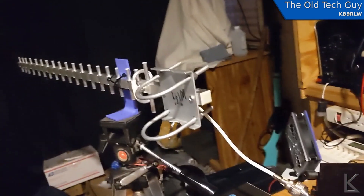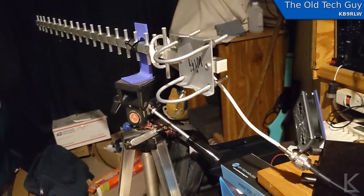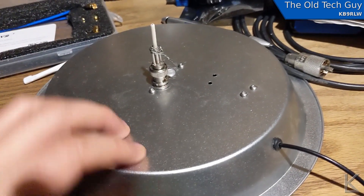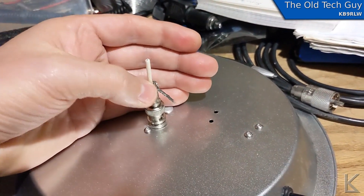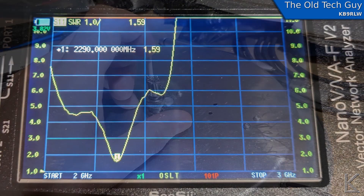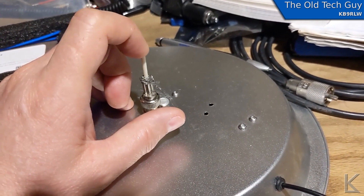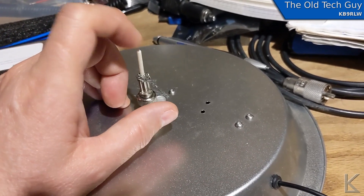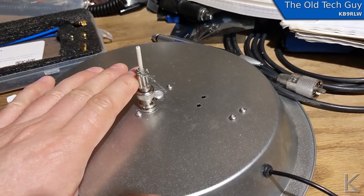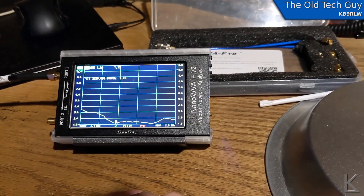What I'm going to do is put the Nano VNA into signal generator mode on 2.29 gigahertz. Then I'm going to put this Yagi with the Nano VNA sitting in a little pouch down the hall, about 9 feet or 3 meters away from the desk, pointing at the desk. Over here at the desk, I'll have this Pi tin that I use for testing rubber duck antennas with this little antenna I made out of a short stub of coax. I've already trimmed and tuned this — it's resonant at 2.29 gigahertz. It's outside the 2.4 gigahertz Wi-Fi range, so we won't get any interference from Wi-Fi. The tiny SA spectrum analyzer connected to it will receive signals coming from the signal generator Nano VNA and the Yagi 9 feet away. That will give me a directional source and I can then do some measurements.